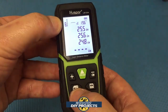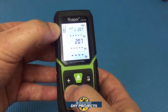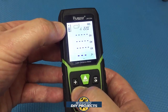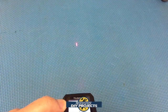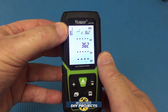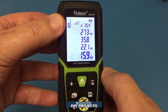You can add or subtract, adjust volume up and down. You can save data using the disk button — that's your storage. You can clear and turn things off. Up here you select the different measurement modes: area, volume, Pythagorean, and cycle through them easily. And for straight measurements, that's just as easy to get to. Over here you hit the button to turn on the laser. You can see the laser pointer is on — point it to whatever you want to measure and it'll do it for you. You can switch between inches, feet, and meters. The LCD screen is very clear and well lit — very convenient.